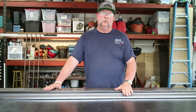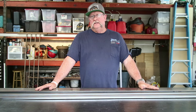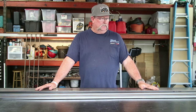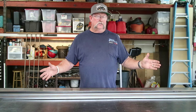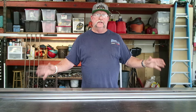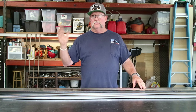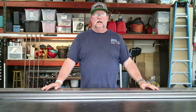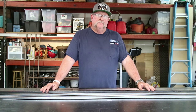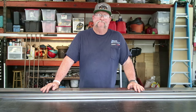I've got some 5/8 square tube pickets, and it's roughly going to be about 10 feet long and about 18 inches tall. And I'm going to have three legs that are going to be about 18 to 20 inches long, and those will be going into a concrete footing, and that's what's going to hold this thing between this block wall that I have and a small planter wall. For a better illustration, let me draw you a picture and I'll show you what that looks like, and then we'll get started on this project.